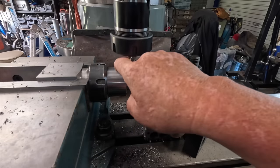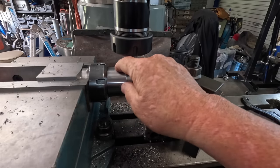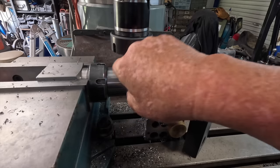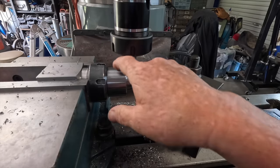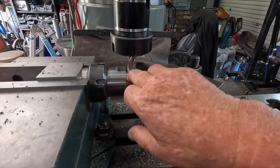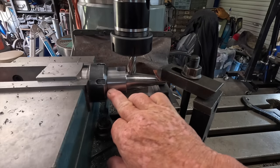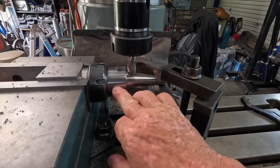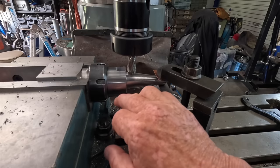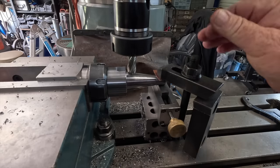I certainly reckon them headstock bearings on those spindle bearings need attention pretty bad, which is part and parcel of it. But anyway, I've got to reset this up again now to put some slots 90 degrees to these, 10 mil wide I think they are, for the dogs, for the face mill.